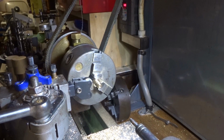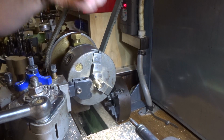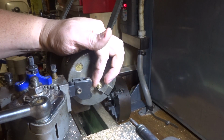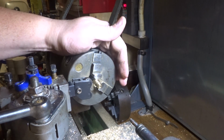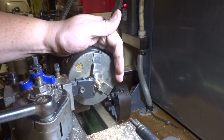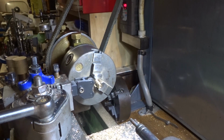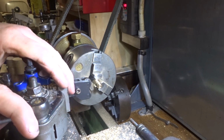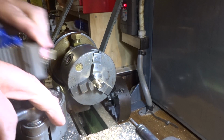I didn't have the camera on. Basically, in brass, this is a very simple job. Set your knurling tool up on centre, and a bit of oil, nice steady slow speed, feed it in until you can see the knurl and feed it out again, job's done. You don't have to move it along, you don't have to do anything. We can part this nut off.